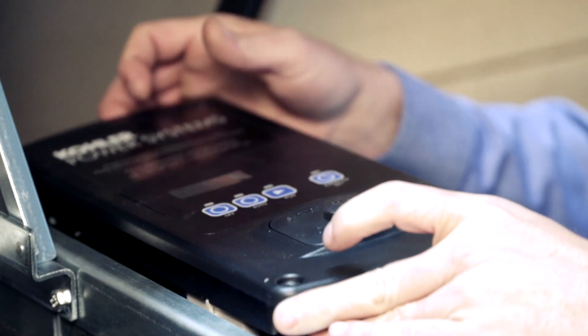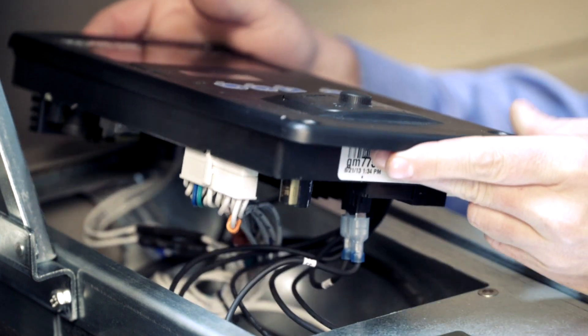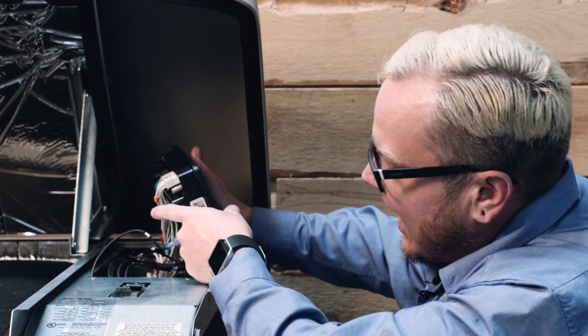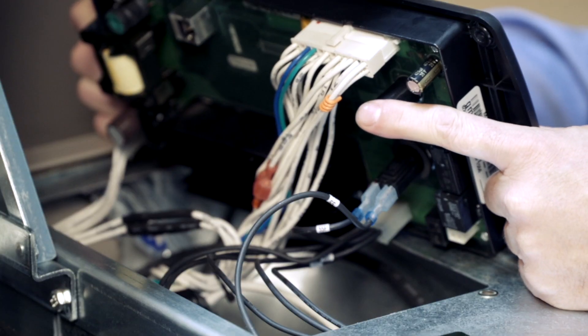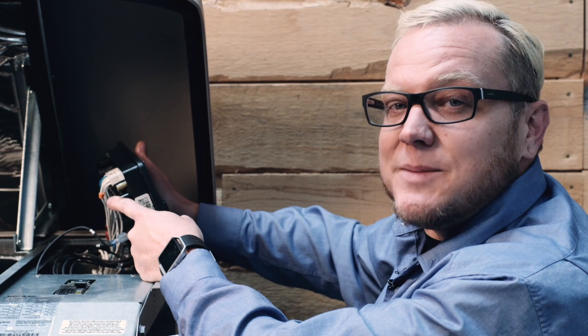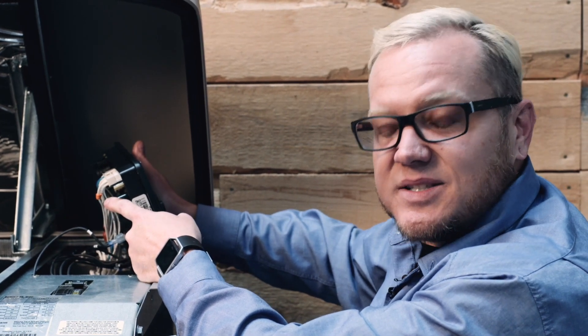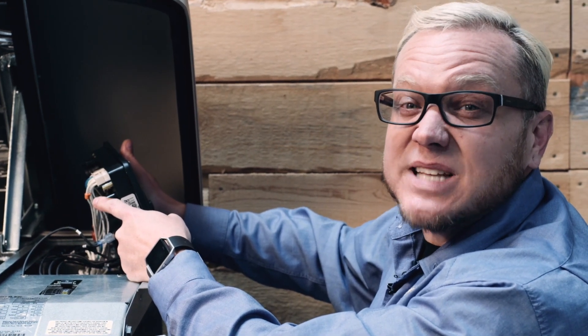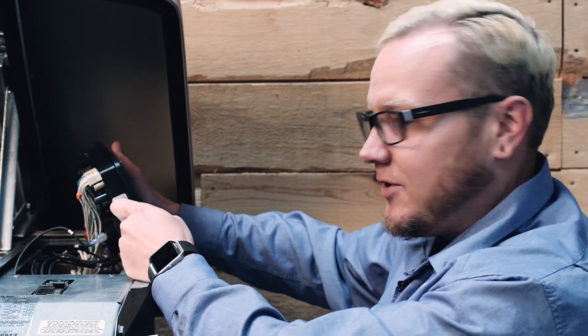We talked about having to track down this 12-volt run signal coming from the Kohler generator. I want to settle where it is once and for all because it's a real common trip point for people. I like to access it behind the controller. Take out these two screws, lift the controller up, and we can find our number 70 wires hidden in here. This orange wire won't be on yours — just keep in mind that this is where the number 70 wire is. It's labeled 70 right on it, and don't make the mistake of using wire 71. That's a crank signal and it won't work for this application.